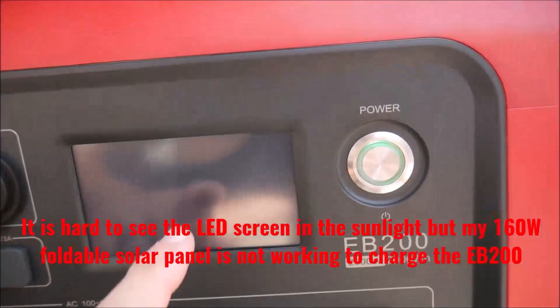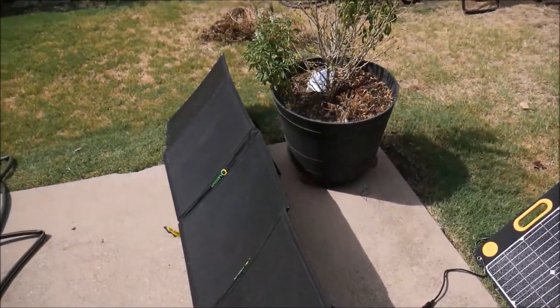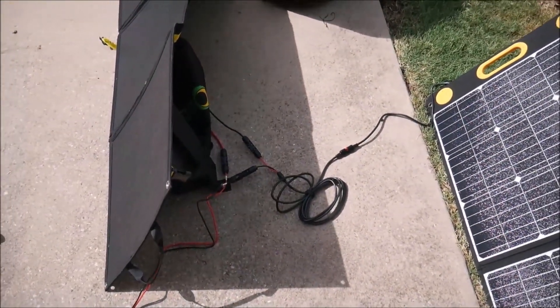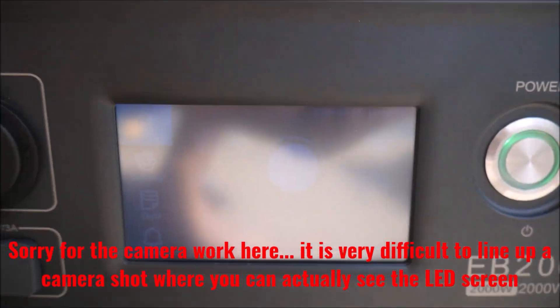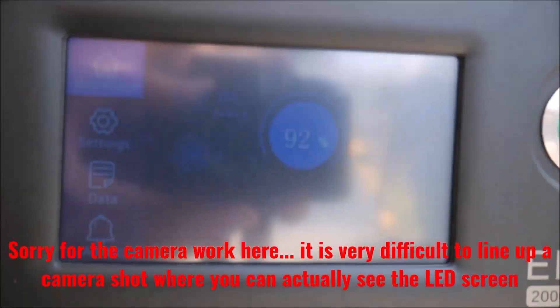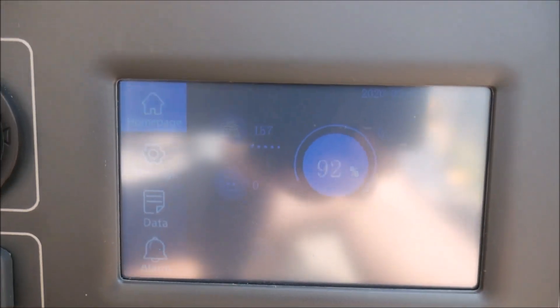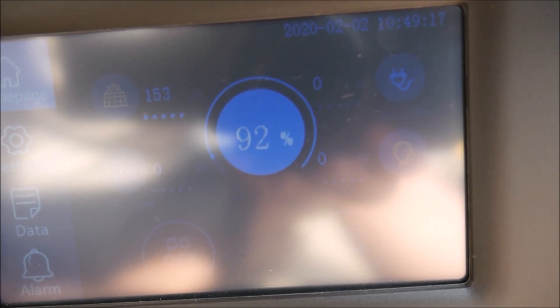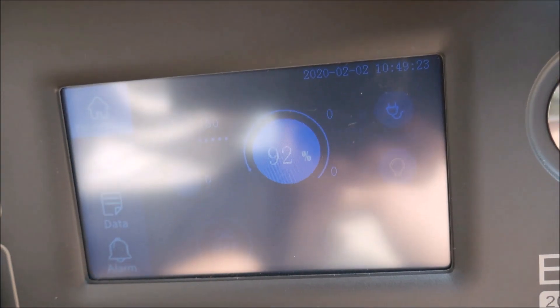Please keep in mind, I'm not affiliated with these products or companies in any way — just trying to help you guys out. One option is to use multiple 12-volt solar panels and wire them in series, like I've done here. That's actually really easy to do and doesn't require any additional cables or adapters, as long as the solar panels you're using have industry-standard MC4 connectors on their cables. If you need help making that happen, I do have a video on my channel that explains series wiring, or you can contact me or leave a comment for help. Two solar panels can work, but they need to have an operating voltage of at least 18 volts each, or it won't work. The safer bet would be to use at least three 12-volt panels, and then you don't have to worry about their specs.